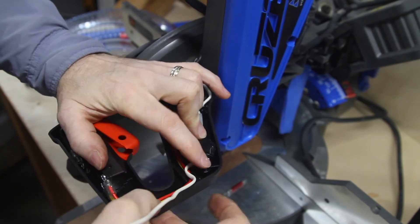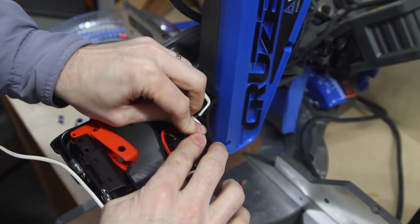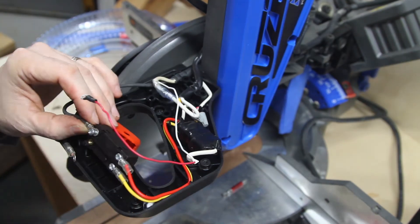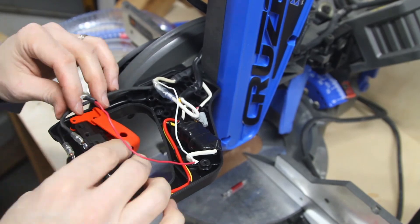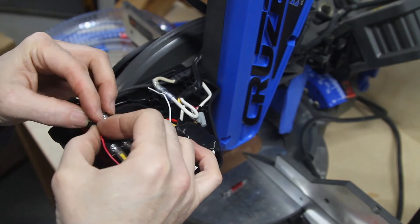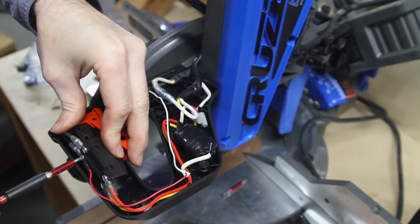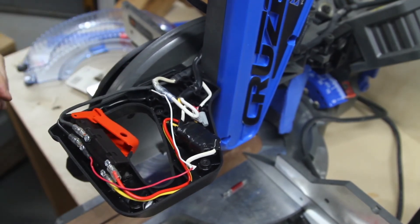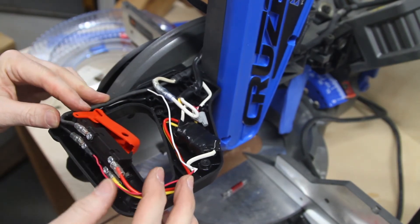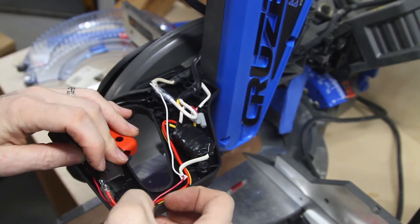What I'm going to do is run the 120 volt hot to the power switch, rather than cutting a hole and making another switch for the LED — I just didn't want to do that. I did not have to take off that top terminal connector; you only need the bottom one. That switch, by the way, is like a standard Black & Decker part — it looks to be the same thing on the Dewalt and seems to be a very widely used switch in these saws.